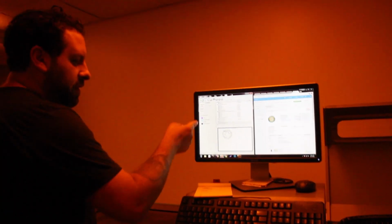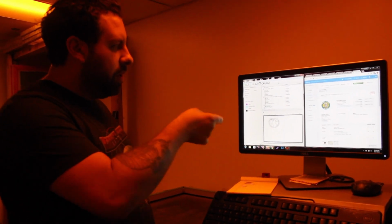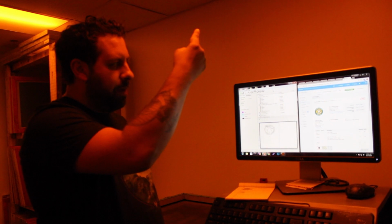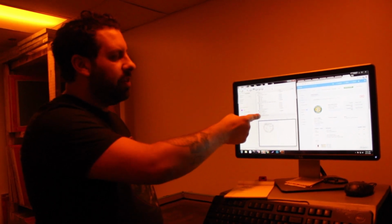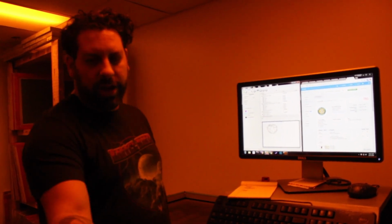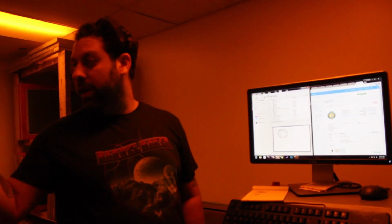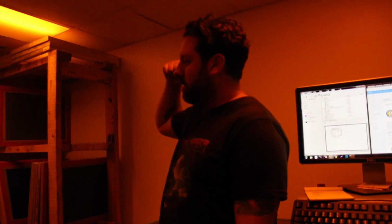So this is where we burn screens. On this side is the direct-to-screen program. All of our color separations get entered into Dropbox, and she opens the files up in here, and basically each screen gets a color. After you print a few, they get exposed. That was the light box with the vacuum that you remember seeing in the video. And then we'll wash them out on the other side.